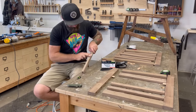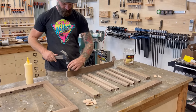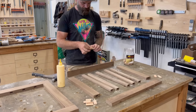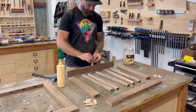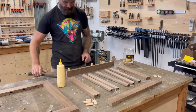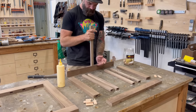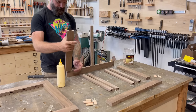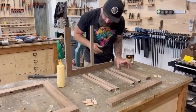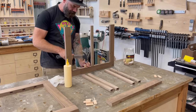With all my slats mortised out, I wanted to soften the edges a bit before gluing everything up. So I chucked an eighth-inch round-over bit in my trim router and hit every single edge of each one of my slats — that's four edges for 10 slats, so 40 edges total, but it went pretty quick. Then it was time to finally glue up the two parts of my seat assembly. I'm gluing in the frame pieces on either side and only gluing one slat piece in place — the other four slats I'm just going to let float with just dominoes, no glue, because those slats are sandwiched in between the top and bottom rail so they can't go anywhere.